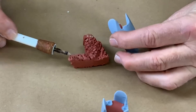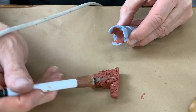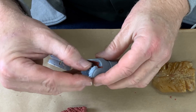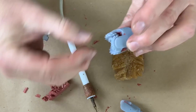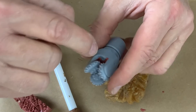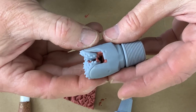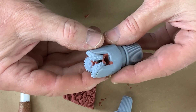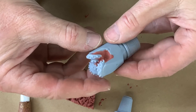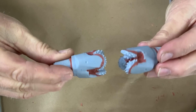It doesn't do any good if I sculpt a prototype that can't be manufactured, so you've got to make the necessary changes to respect the process of manufacturing. Now we're going to apply the cutter heads to the bit. Down in there, you can still see we're going to have to do some filling in. You can just see those deep holes in there — you just can't have those spaces because the mold material would just get trapped. So I'm just going through filling it in, because that's what you've got to do to make this into a castable piece. The parts are all waxed up and ready to go, and they're looking pretty nice.